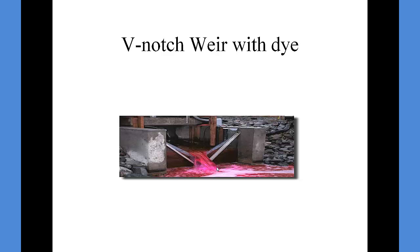So what the city did was go in and conduct dye tests. It had a particular color of dye that it would flush down a toilet. Depending on the color that came out of the storm sewer, they would be able to backtrack, find out which home was illegally hooked up, and then issue orders to have it repaired. It was likely someone who was trying to cut corners, ran their pipe until they hit a sewer, and didn't know the difference between a storm and a sanitary sewer.